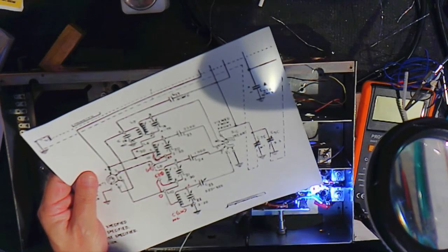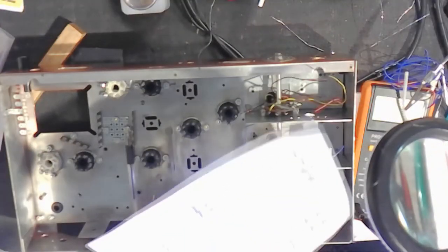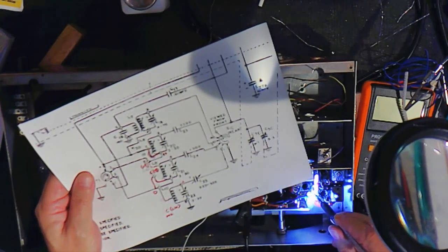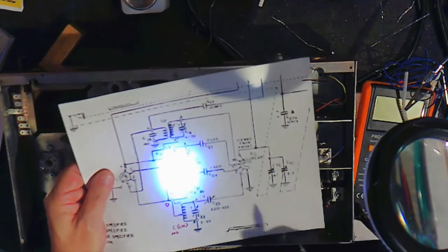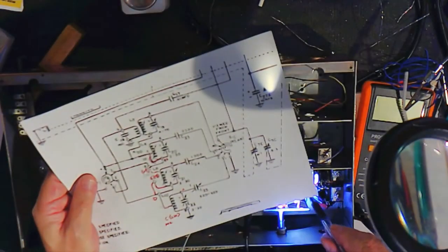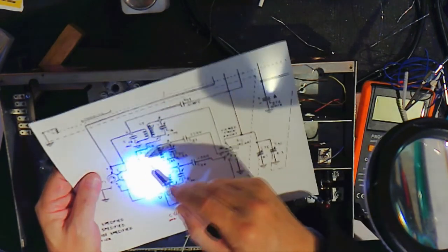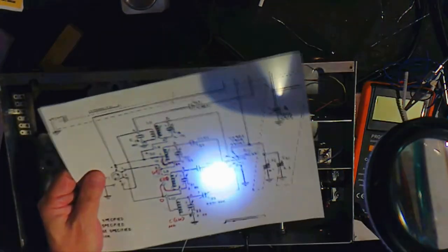Rev 1. That's what confuses me. D on here is connected to D on here. So this is L9 and it's L8. Rev 7. Okay. So D and D are connected together into B on L8. Don't you love it? And then here's the 10 ohm resistor that goes to pin 4 of the switch, which comes around also to, actually goes into here, which is another 10 ohm resistor, which goes to another position on the mixer.